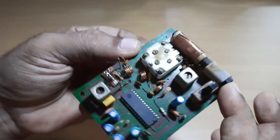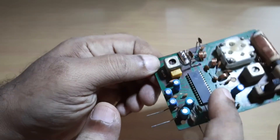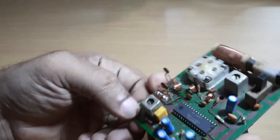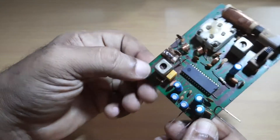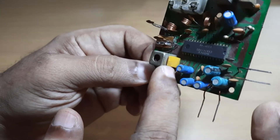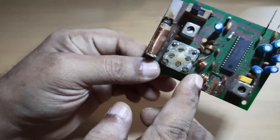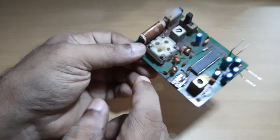This is the antenna section, and you can also see the rod that is inserted. This seems like an IF tuner — an intermediate frequency tuner based on around 455 kilohertz. This seems like a 455 kilohertz IF filter. These are the smaller FM antenna and oscillator coils.